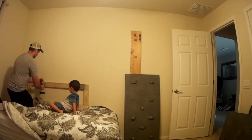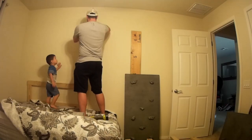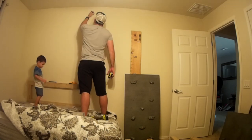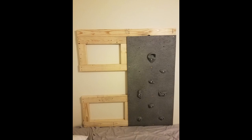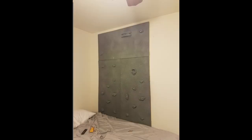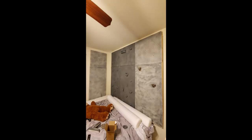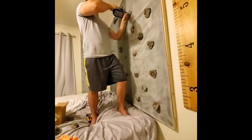If I could go back and start this project over again, I probably would have used 2x6s rather than 2x4s, just so I have a little more spacing since the studs are only so big in the walls. I also probably would have used a better plywood — not because this plywood wasn't strong enough, but because sometimes when I put the bolts into the star nuts I accidentally cross-threaded them without realizing it and would rip the star nut out the back. So then I had to take the whole sheet of plywood off to be able to fix it and hammer the star nut back in.